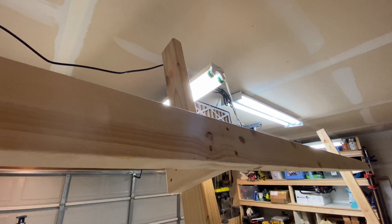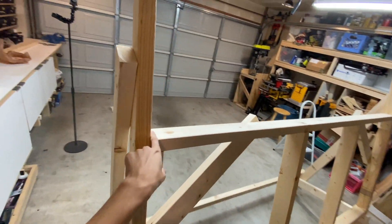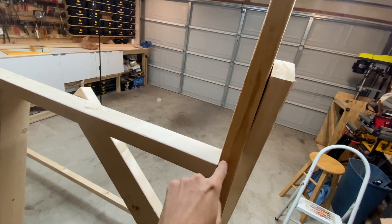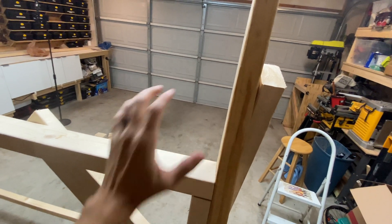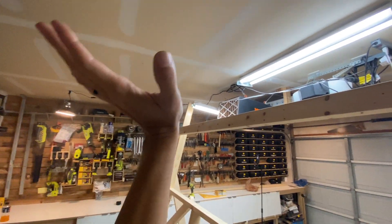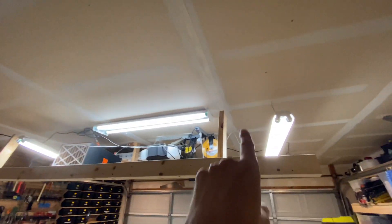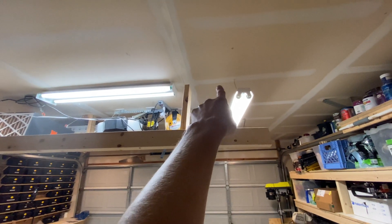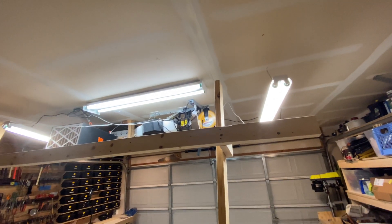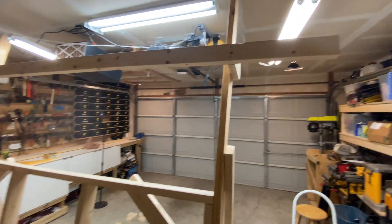I want to be able to put a 2x4 across the top here and across between here and here. Then I will cut right here and put a hinge on the back so that this top part will come forward, then the bottom part will hinge up underneath it. That is why we're bringing this 8 inches in front of this stud, so that extra 8 inches will go back to the stud — because this bottom part is 8 inches longer than this top part. That is the plan.